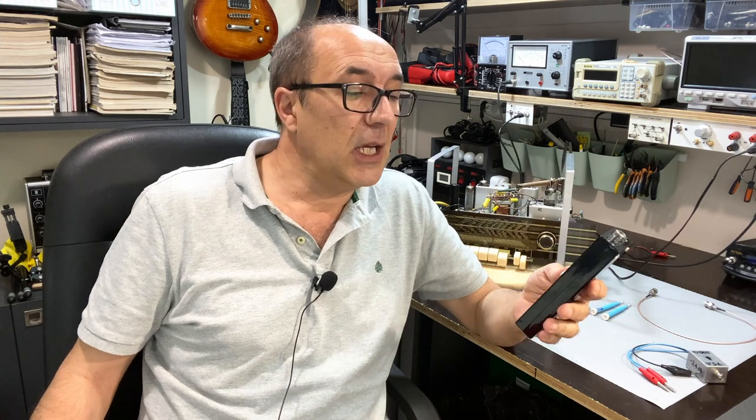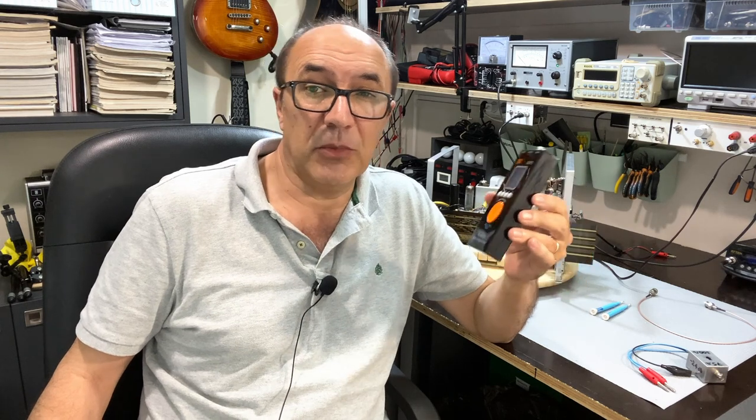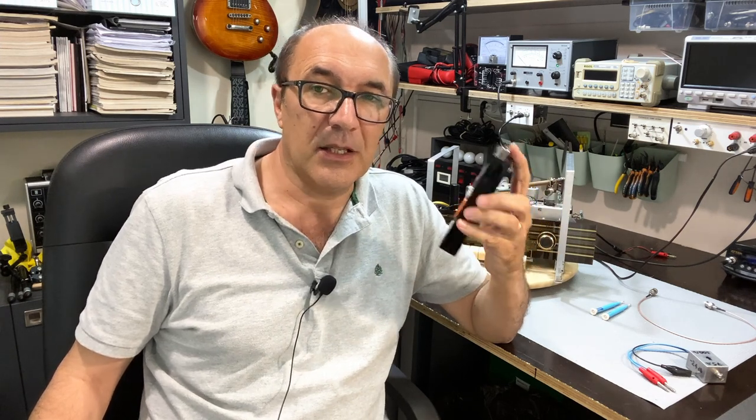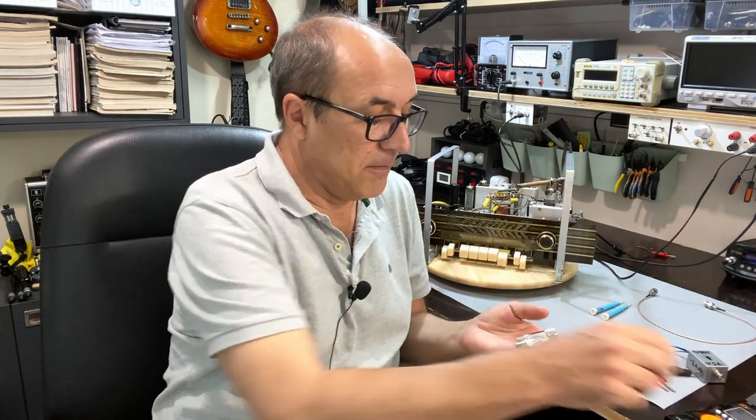What I will be doing is testing this — and to test this, I'm using this little gadget: a stereo test generator. What it can do is generate an FM signal with modulation — you can put a tone on it. You can put three tones on it, but the one I normally use is the 1 kHz tone. You can transmit in mono or stereo, mute left signal, mute right signal, or mute both to just have the carrier. I normally use these radios in mono with the 1 kHz signal. This thing comes with a slightly hot — fairly strong — output signal, and this issue has been raised in the comments. But it's not useless, because I got myself some attenuators.